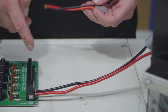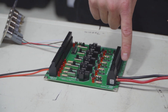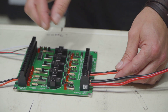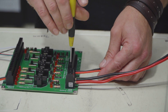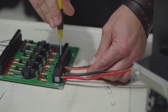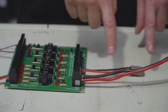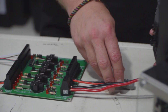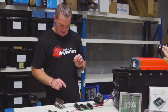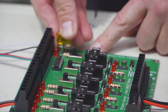These outputs here, as soon as you put a fuse into supply one and apply power, will be live and fused through supply one. So load one and number one here are both fused through the supply one fuse — that's quite important to know. You can decide if you just want to use one of the outputs for a constant load running off that fuse, or pick fuses that can handle both your constant load and whatever you switch at the same time.